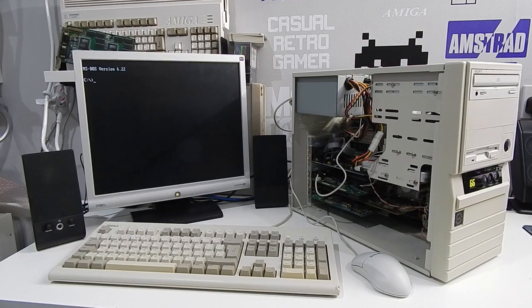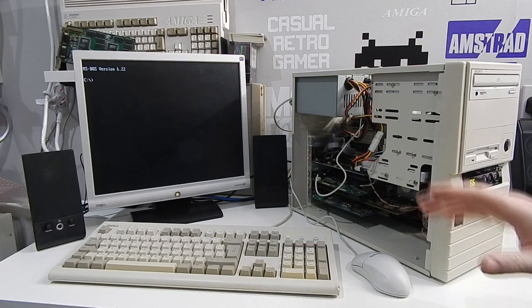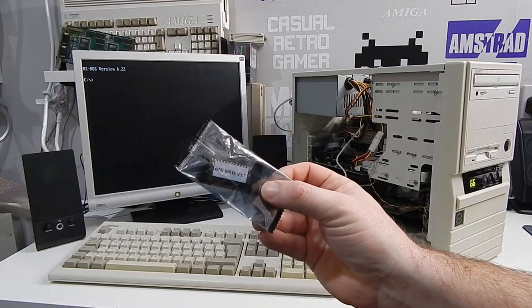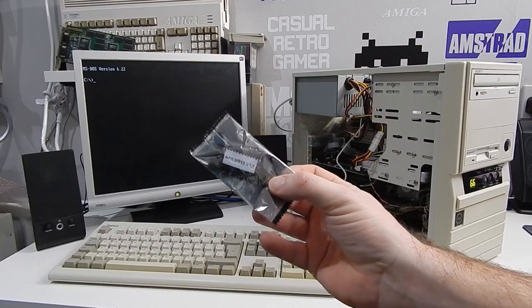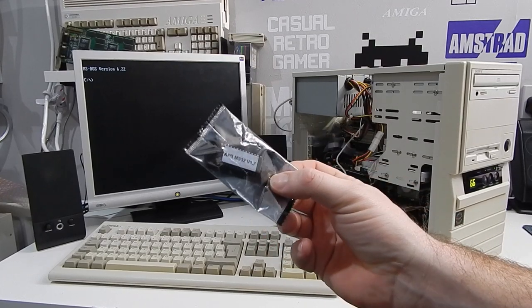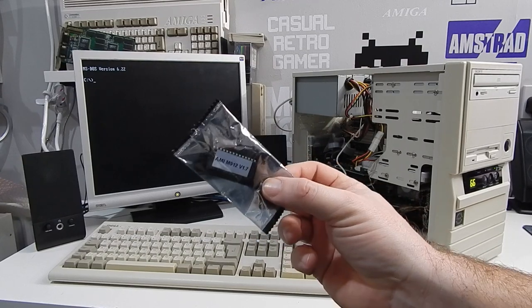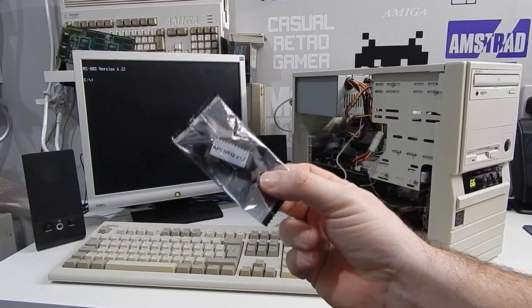You see, the board in here did ship with fake cache chips installed, and that BIOS had to be patched to show them up as real. I think something funny's going on there when we try to fit the full 1 MB of cache that this machine supports. So with thanks to Chrissy over on Discord, we have a new EEPROM here to drop into the machine with the latest version of the BIOS for this PC chip's motherboard. And fingers crossed, this will solve the problem.